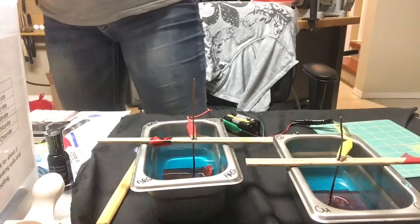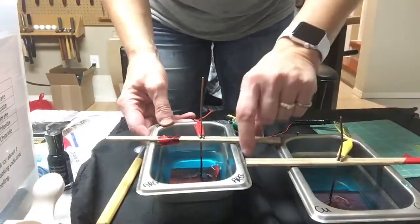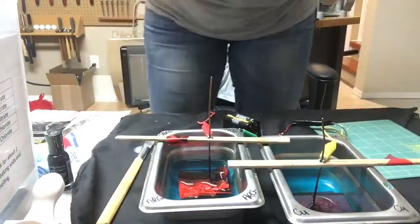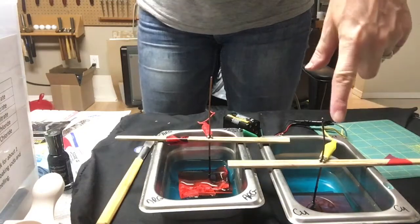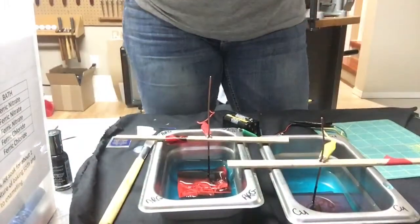I have a brush here and I'm just going to brush the underside of the metal. It's not necessary but I like doing it just so that it exposes fresh metal for etching. I think that snowflake one is going to etch super super fast so I'll have to keep a close eye on it and check every 15 minutes.